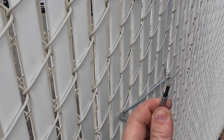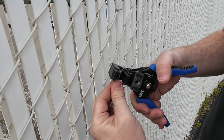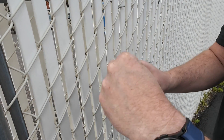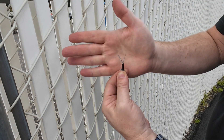Step 9: Inspect the ground braid to ensure all strands are intact and neatly positioned. Step 10: Strip the insulation from the central sensing conductor. Step 11: Confirm you now have a clean shield bundle and exposed sensing wire ready for termination.